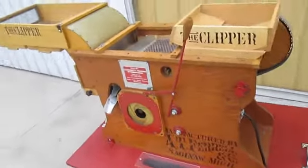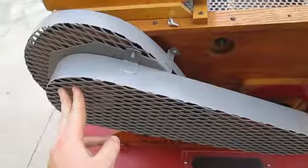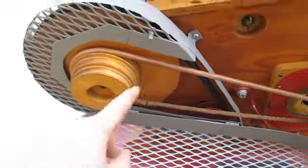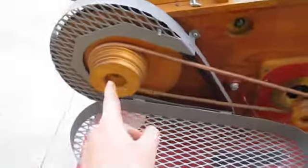In a minute I'm going to fire this up so you can see how smooth it runs. This unit also features a nice folding guard, held on by one wing nut. After you remove it, you can fold it down, which allows you to change the fan speed by changing the pulley ratios.